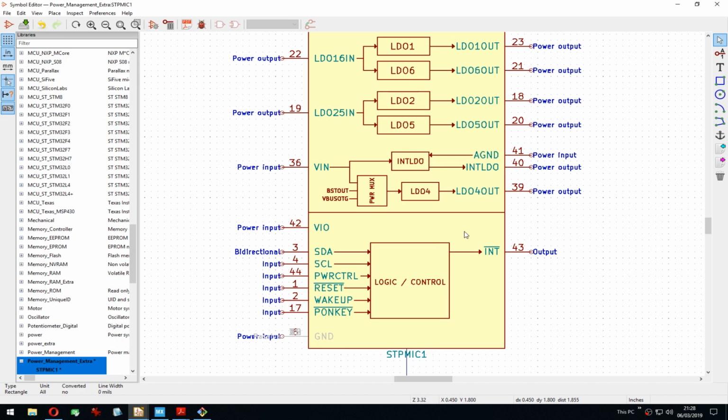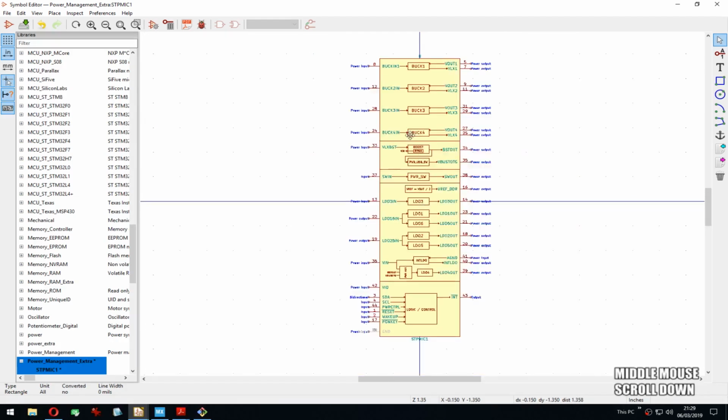This way, your schematic stays the same while the new symbol is still in KiCad libraries. I mean, you wouldn't want KiCad unexpectedly to change your symbol and maybe some pins were swapped. That would be really bad of KiCad, to randomly swap pins in symbols, but it could happen for some reason. So that's why it asked me if I wanted to rescue. But I did not want to rescue because I wanted to use the new version and then just make fixes in my schematic. So that's what happened there.